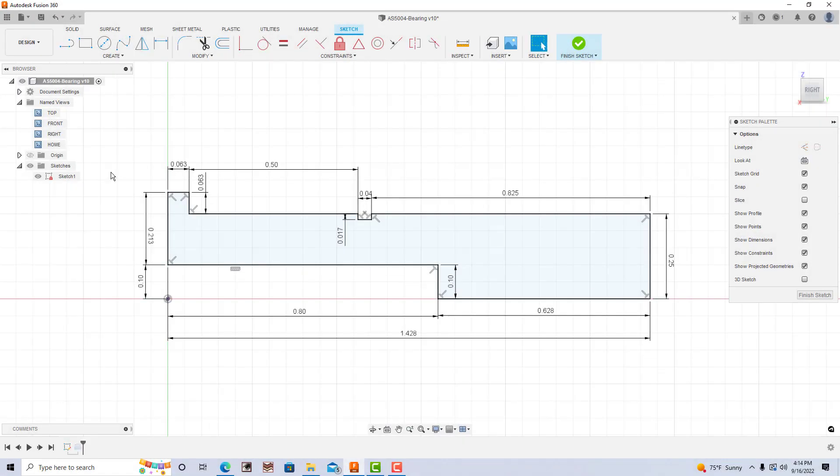I began by first of all designing a sketch of the cross-section of my bearing in Fusion 360. This is the dimension with the center hole, which is both drilled and tapped. I have a small groove here for a snap ring, a step-up lip here, and I got my length and my diameters all set, and then I turn this into a round cylinder.